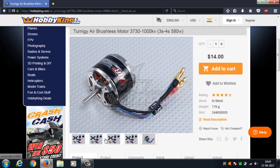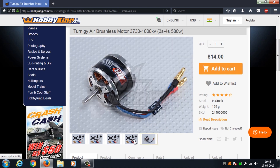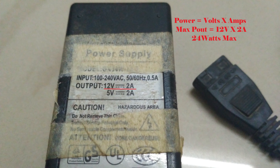Use a current-limited power supply according to the size of the ESC and the motor to test it. This is the BLDC that I am using. It is rated for 580W max, and the no-load current draw is about 1.6A. Since the max power output would be capped, the shorted MOSFET would heat up and may not explode violently. That depends on the size and power of your ESC.